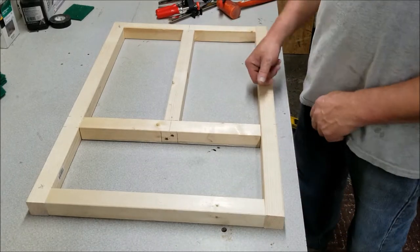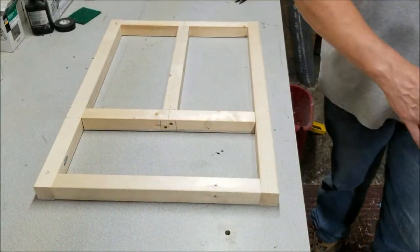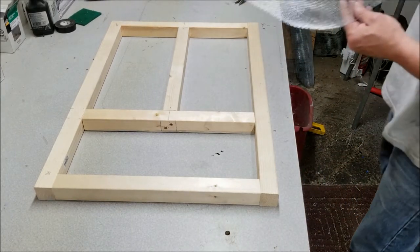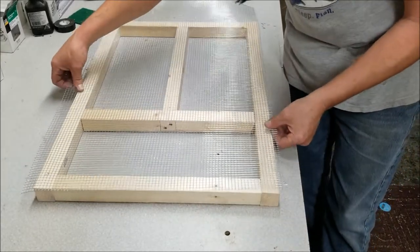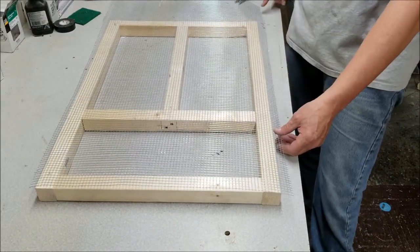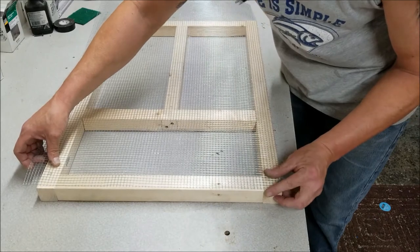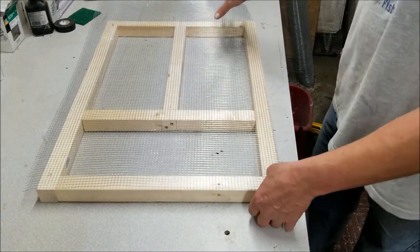I'm going to get the screen ready and show you how to cut it, get it on there, and staple it on. Be careful - when you get the big rolls of screen, especially the quarter-inch, if you cut that little wire it just springs open like crazy. I got a piece that's the basic size I need. Basically just find where your spot is and how many squares you need. I go as far as I can to the edge but not over. I know if I clean up this edge here I'm good. I just cut it at this row and this row - that's what I need to do.